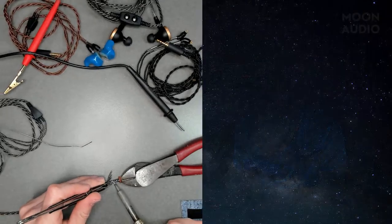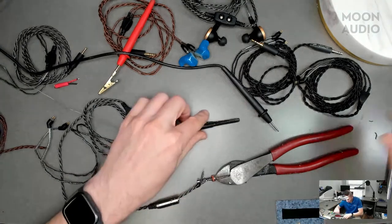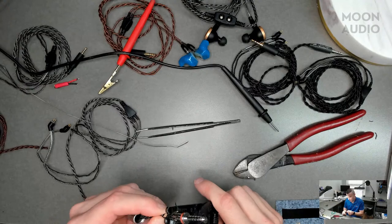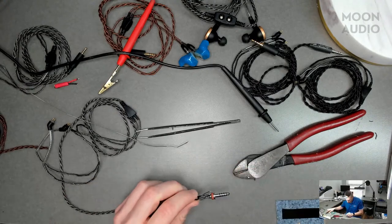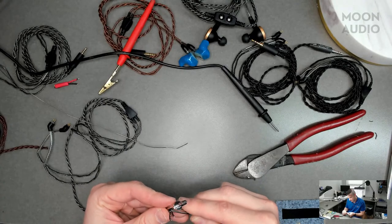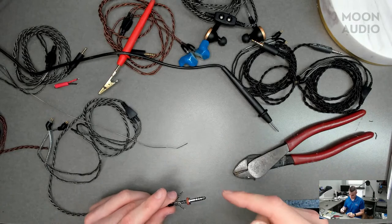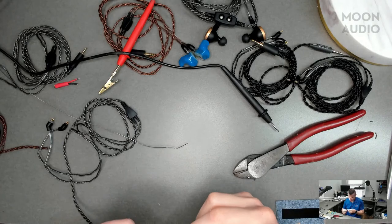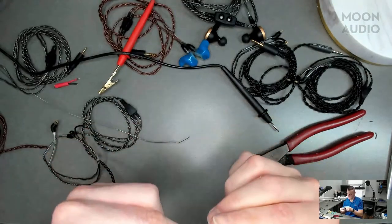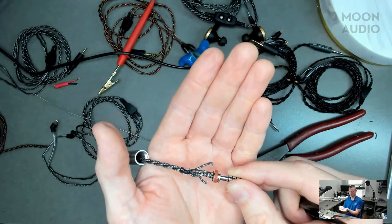So now we're going to start soldering up the connections. This is all experience. I cut these and tin them at different, staggered lengths, so now I can come in and pull that at a right angle, and it fits perfectly right there. It's all pre-measured in my head, muscle memory. Now I've pulled them all at right angles, and they line up mostly perfectly with the solder tab.